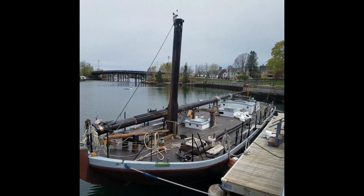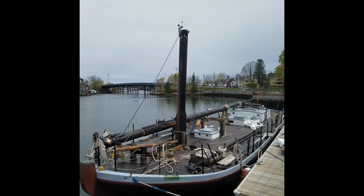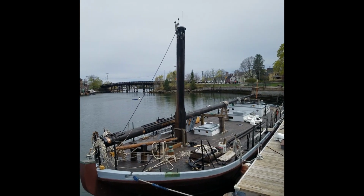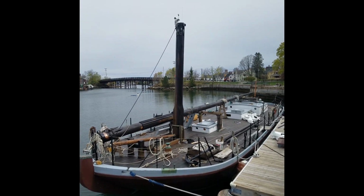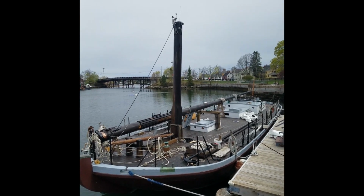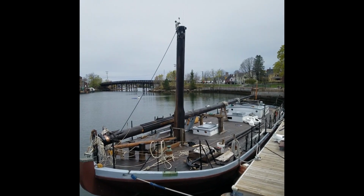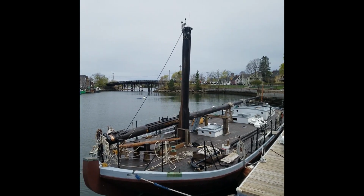To be clear, we don't know of any Gundalows that stepped their masts this way. Many Gundalows of course had this lateen rig where they could lower the yard for bridges, so in our case that reduces our air draft, or our height off the water, from about 65 feet down to 24 feet. We do know of plenty of canal barges and other types of boats that encountered bridges that had taller masts rigged on tabernacles where they could drop the whole mast to clear bridges. So we've rigged ours up this way, so we have a couple of different options.